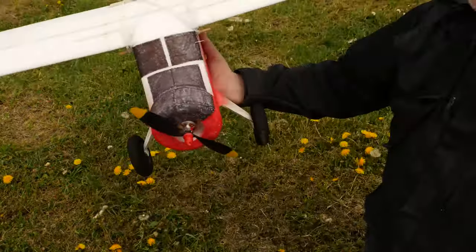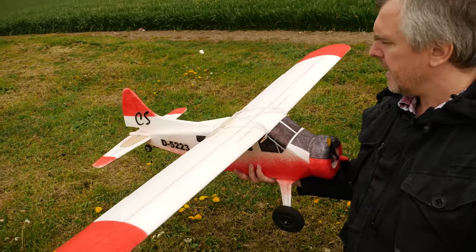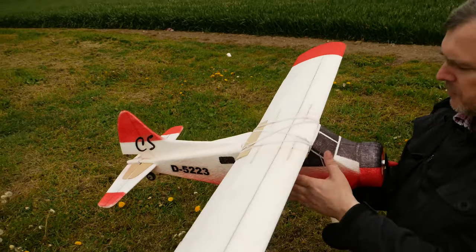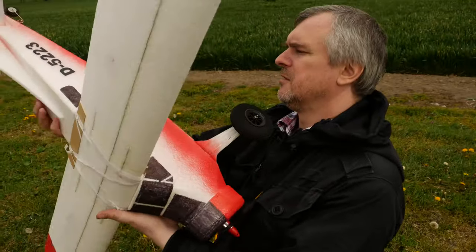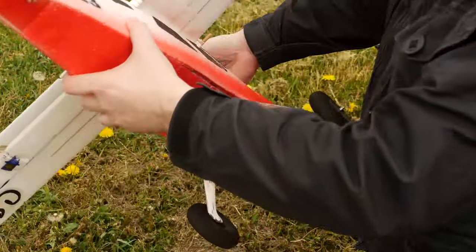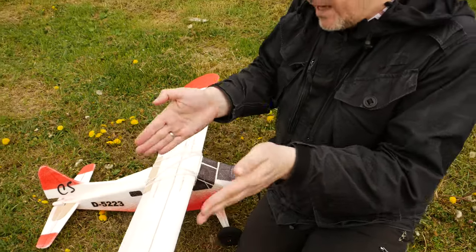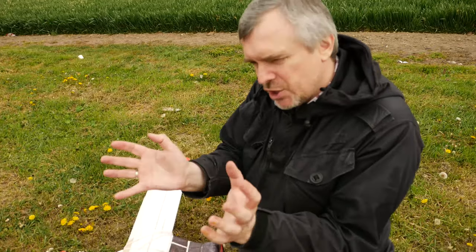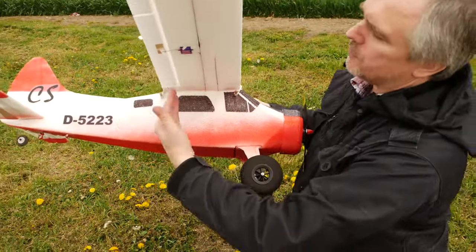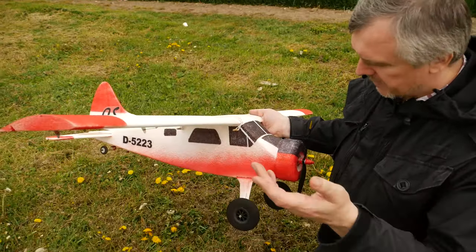This airplane is actually a little bit larger than standard EPP airplanes. And what is interesting about construction? Wing is standard hot wire work, but fuselage is not from one piece of EPP. This is just from flat fin parts, and you glue them in the shape of fuselage like paper cutout, if you understand me. And inside are of course some solid parts for right shape.